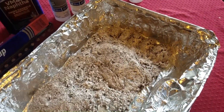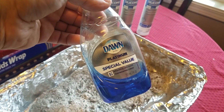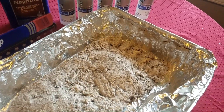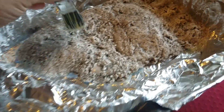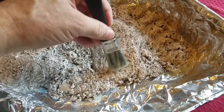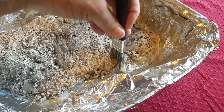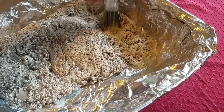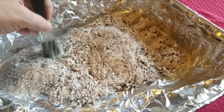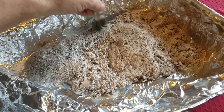The next thing I did was cover it with Dawn dish soap — this is my release agent so that the silicone caulking does not stick to it. You put the soap on and then I like to go through the grooves with a paintbrush just to make sure the small indentations are not full of soap, so the silicone will bond down inside of them and we'll get a nice detailed cast out of it.